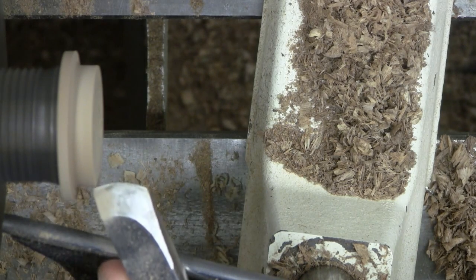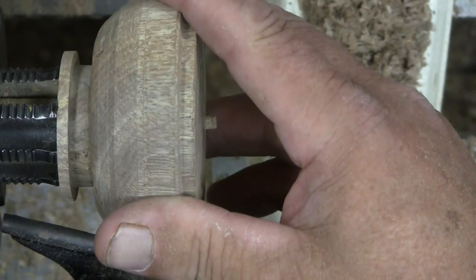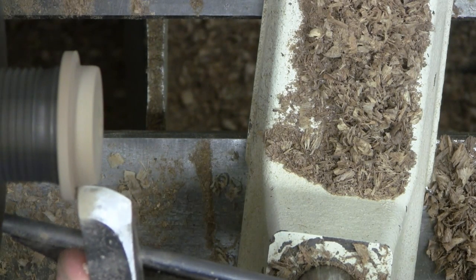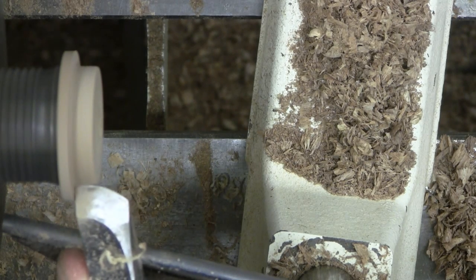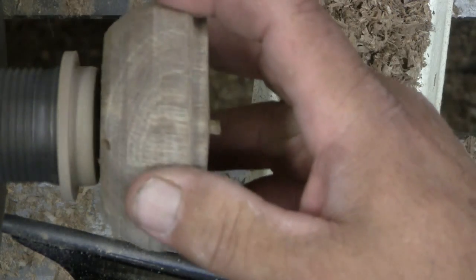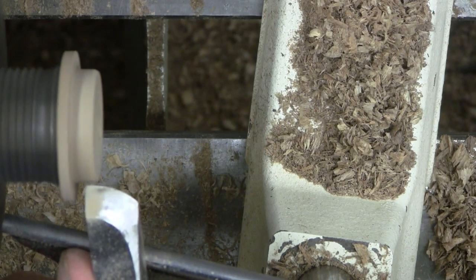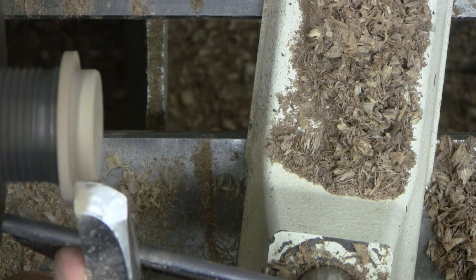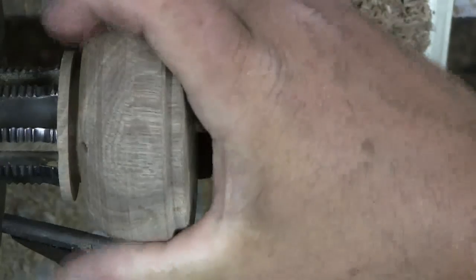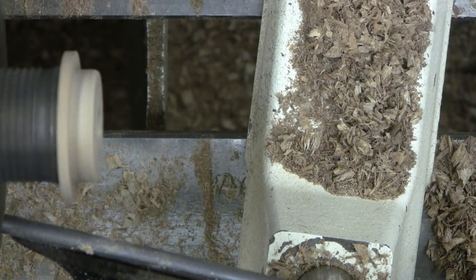So when I do these box lids, I do a little taper right there, and I'm trying to keep it pretty straight. I want it to be snug and not necessarily a pop type fit, but kind of a tight little slider. The hole in the cap shrinking? Yeah, it probably is a little bit. Either that or I've just got a little bit of a taper from about right there to the back. I know that isn't all of it because it isn't seating down on the bottom yet.